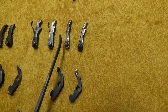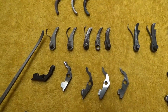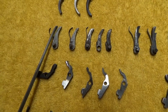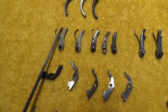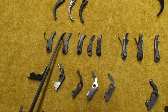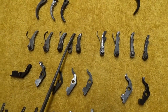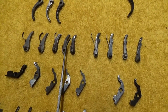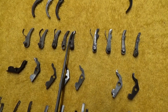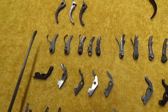And we've had a couple of breakages here on these 2. So when that spring does break, it's not going to allow the hand then to be forced into the notches on that cylinder. So maybe when you cock your gun back and you find out that the cylinder isn't turning, a very likely suspect here would be that your spring on the hand is broken off, or at least maybe it's become really weak, and if it's weak enough, then that hand won't get forced out into the notches on the cylinder, and it might not turn as you bring the hammer back.